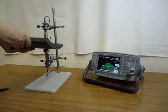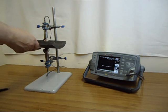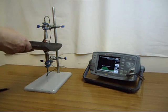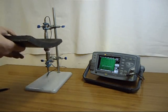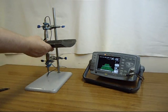Now if we introduce a real part with defects — in this case a piece of friction material between the probes — we will see much more variation in ultrasound transmission from one area to another. In this case the central region of the part is defective and transmits very little sound.